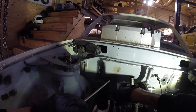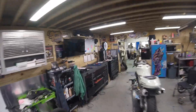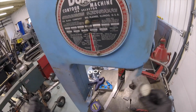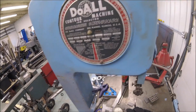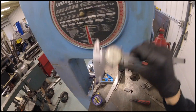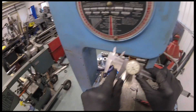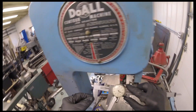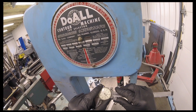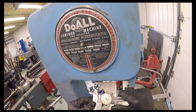So let me go get on the lathe and whip up a couple little bungs. That'll locate this bolt nice and tight on the ID and give me some meat to weld to. Every time you use a caliper or any measuring device, make sure you clean off the faces of it and check your zero. That's why you check your zero — especially these fabrication ones — because there's always some dirt or something in them. Always check your zero, just get in the habit.